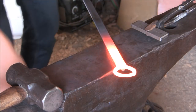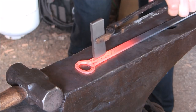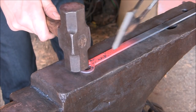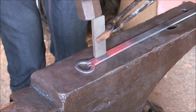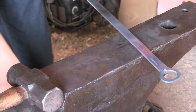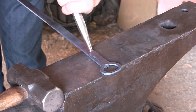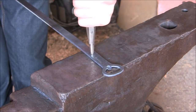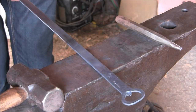And now what I'm going to do is take this little stamp of mine and put it right here. And then we're going to punch a hole just behind this for your key ring or whatever — right about here we'll just mark that — and punch that out in the next heat.